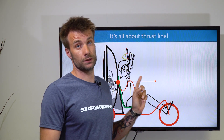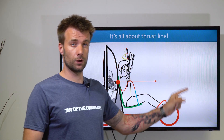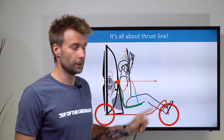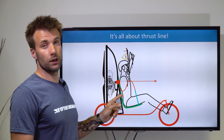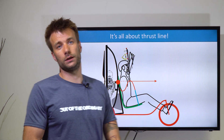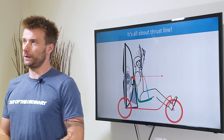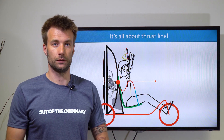It may sound intuitive because you want the thrust line to be horizontal to have the fastest acceleration. Wrong. This setup will slow you down on takeoff. It will make the takeoff less efficient, less reliable, less predictable, and definitely decrease your success rate on takeoffs. I will explain every single step during the takeoff phase and you will see how this design is completely wrong from the beginning to the end.